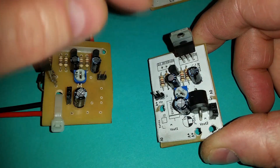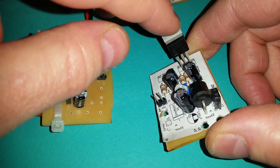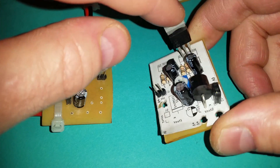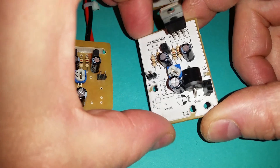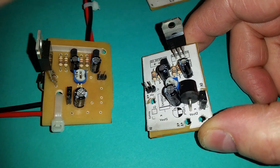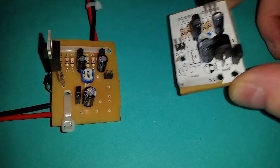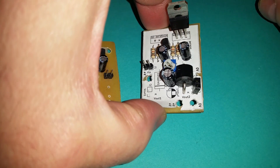The same design here, but as you can see the diode is more powerful, so I can provide 10 amps. I've got a Darlington driver — a TIP147 — which can also provide up to 10 amps of power. This is more expensive; these probably cost about a pound each compared to the smaller diode on the previous circuit, but it can drive more powerful motors.